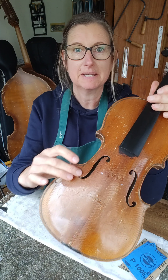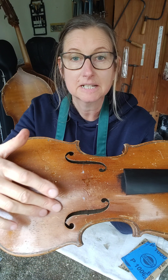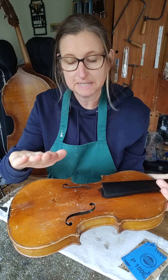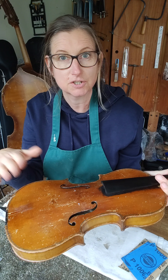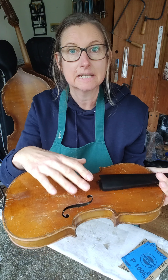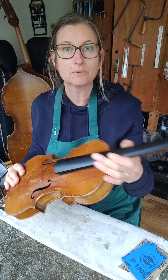You'll see there are some shiny bits on the front here. I have been starting to put some varnish filler in the places where the varnish is really pitted, because I need to fill those gaps before I can retouch the surface. Since it takes a while to dry, I thought I'd get ahead and start filling in these little bits of varnish on the front.